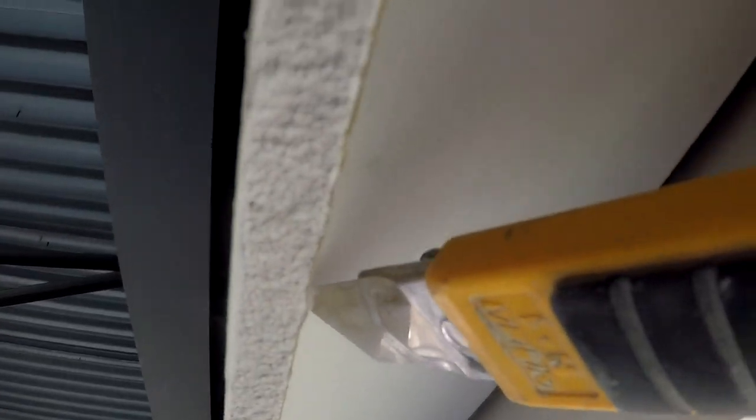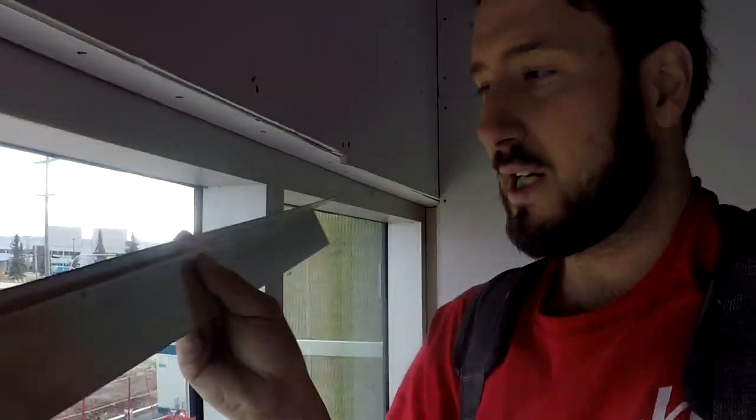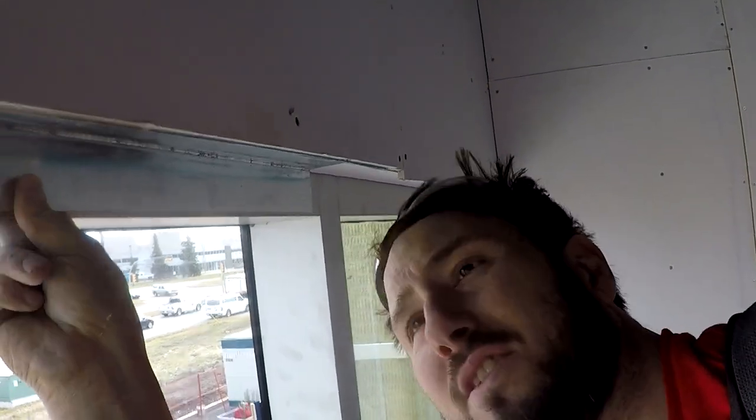I'm cutting my strips and rasping both sides. When I snap it I'll use my rasp to make it nice and smooth on both sides. Then I'm back-cutting with my knife at a slight angle — that's for the corner bead — and then gently snap it up. It comes up straight and you cut it off. When routing drywall on drywall, get a piece of steel and use it as a guide for your router bit.